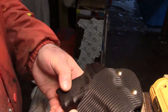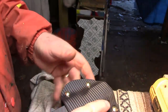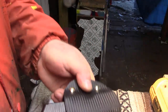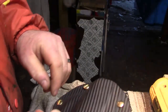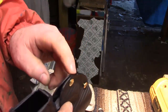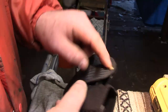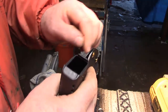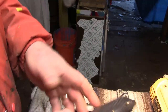Okay. I think it does it. I think it looks pretty good. Alright, it fits. I can grab onto it and pull it out. Once it's on a belt, naturally it'll work a little easier. I do have to make a little adjustment on it though. I'm going to actually take this screw out. I'm going to put a little piece of rubber gasket in there and tighten back down on it, so it'll give me a roller as well as a little bit of a tensioner. So, but that's it so far.